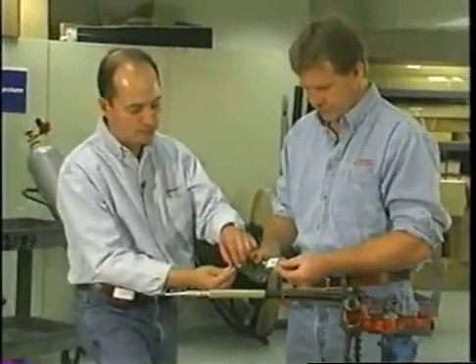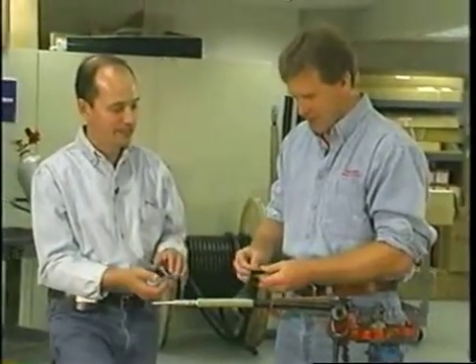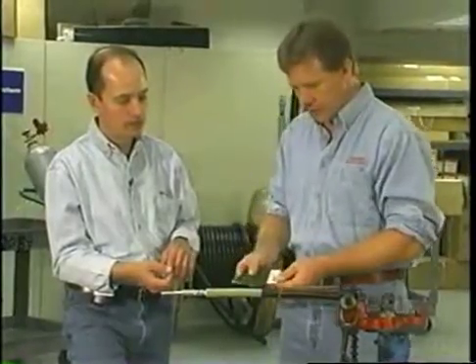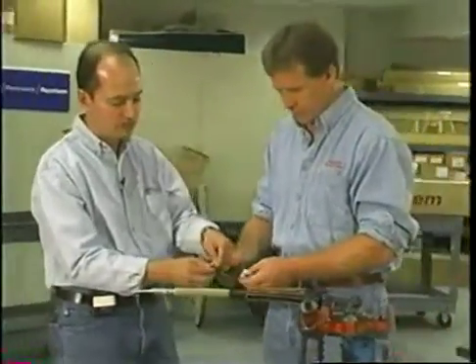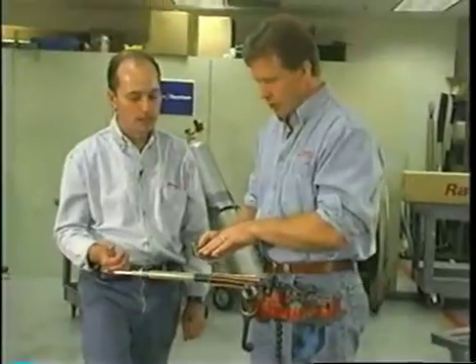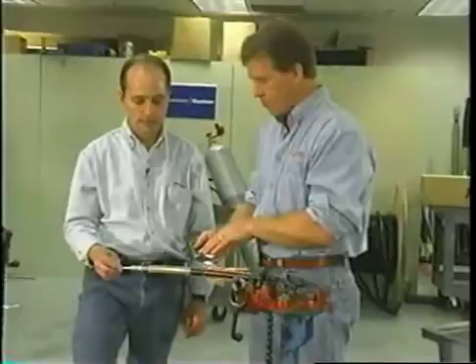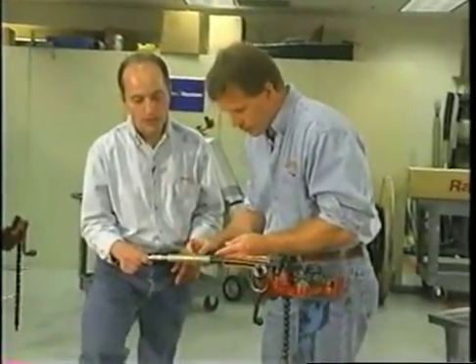This is a different stress control than I'm used to. Usually I see tubings. Yeah, this is actually a stress control patch that can be pre-positioned on the cable. I see, and what kind of material is this? This looks different than everything I've seen. Yeah, this is actually a metal oxide matrix material, and this stress control material, which has been newly developed, allows this termination to have a higher BIL.